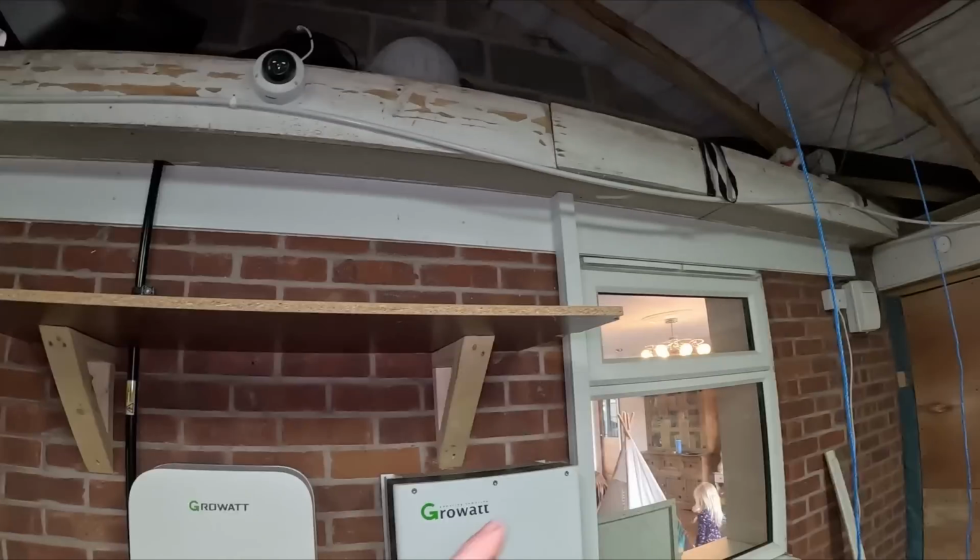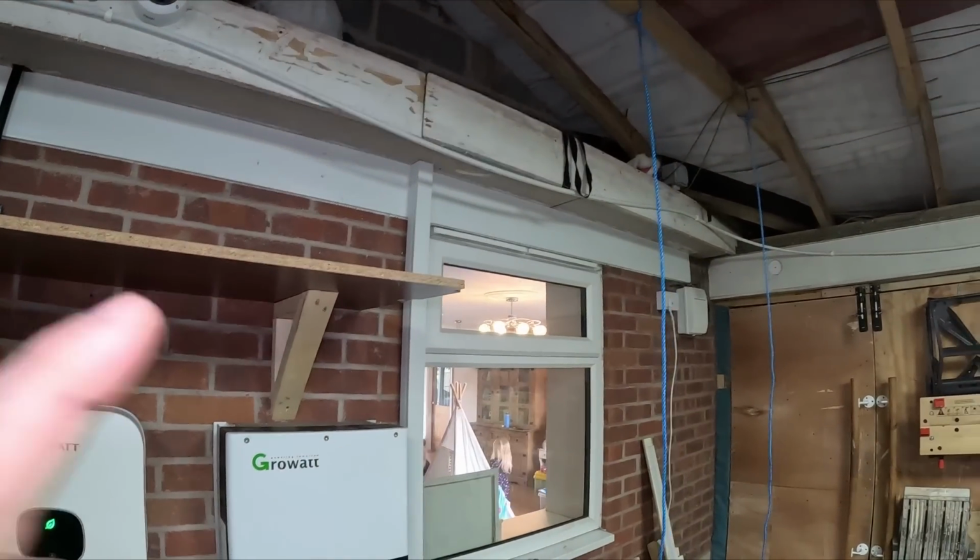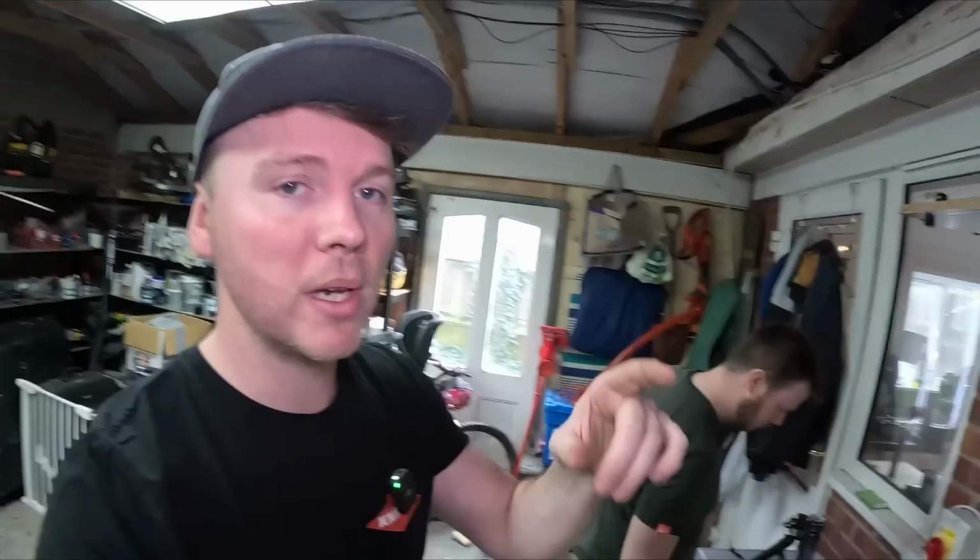Yeah. And obviously it's very helpful that downstairs has got a loft here. Your main part of the house, you're not that lucky. But if you get bigger light fittings with bigger bases, you can fit them within. So the light fitting that's in the lounge, theoretically, if the load and the switch and everything went to that, you could easily fit the smart switch within the ceiling.